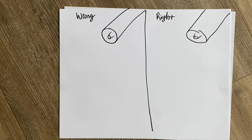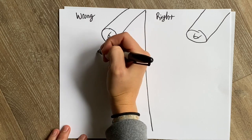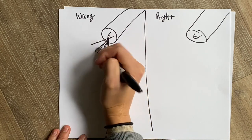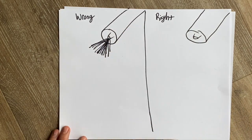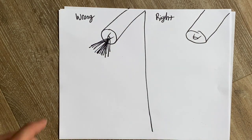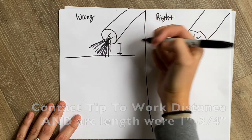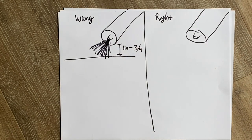When we were first welding, you would pull the trigger on the gun, and wire would come out, and then the arc would come straight from the contact tip as a spray. So it was spraying straight from the contact tip — no wire was actually coming down — which indicates that our arc length was very long from the workpiece, about one inch to three-quarters of an inch. That is too long of an arc, and that is what causes your burn back, or the wire sticking into the tip when the wire is not actually coming out from the contact tip.